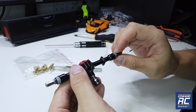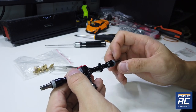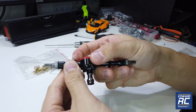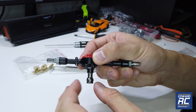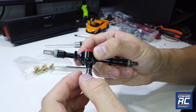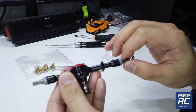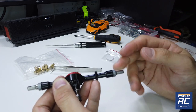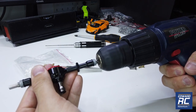At the output shaft, if there's a slight bind, I think this is a good thing so that you give it a run-in and it meshes properly. Otherwise, if your output shaft is very smooth when spinning, I think you will get jammed at certain angles. Because the actual issue is that free play at the input shaft causes it to swing left and right, causing the gear to not mesh properly. When it swings to one side, the gears actually separate and then collide together, causing the jam. So you want to close up the mesh between the input gear and the ring gear as much as possible without causing it to bind completely.